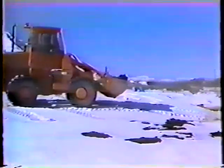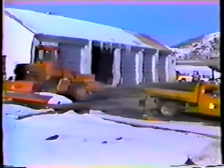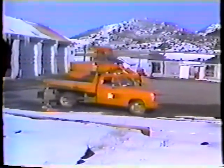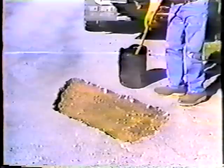The first thing you need is a good grade of asphalt mix, or mulch as many people call it. The mulch can come from a stockpile of blade-mixed asphalt or from a plant — again, as long as it's a good grade. It's best to load the mulch before you load your tools and signs. Be sure to note the quantity before and after you patch so you can tell your supervisor how much material was used. The only other material you need is tack oil — any good grade will work, but the important thing is that you use it. There is no way the patch will last without a good tack.